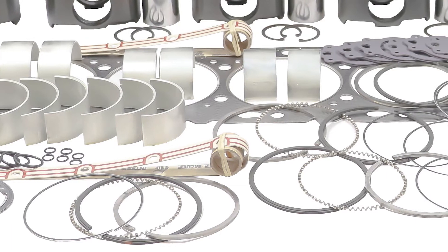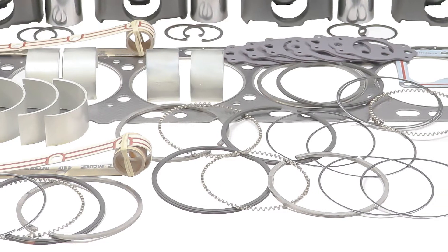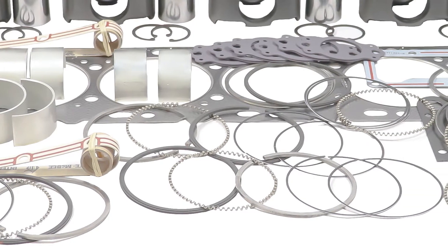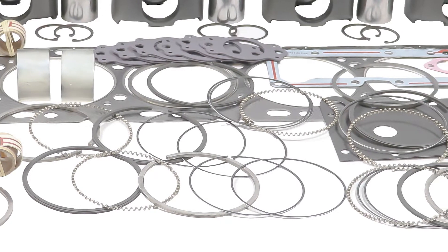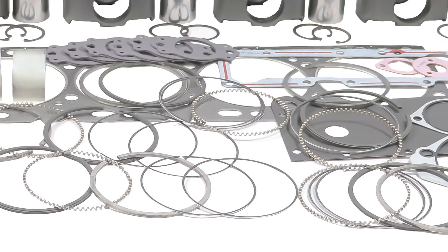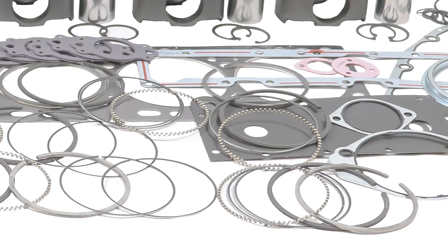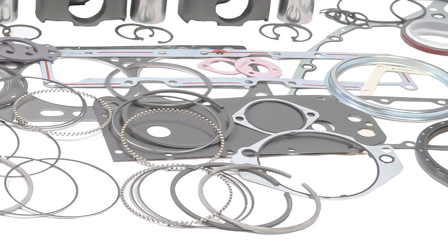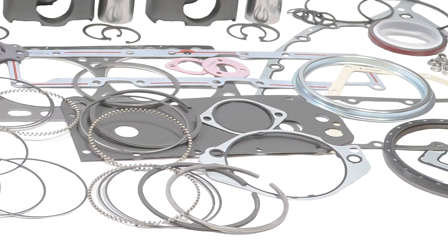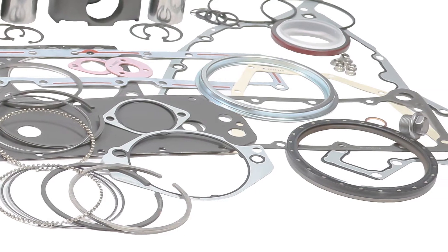The piston rings look a little confusing, but the oil control ring on these gas engines is a three-piece design. You're used to seeing conventional two-piece oil control rings on most diesel and a lot of natural gas applications, but this one is unique — it's basically an automotive design ring. It's got two separate rails, upper and lower, and then a serpentine expander that fits in between them to give pressure to the ring. So the oil control ring looks a little different if you see one.